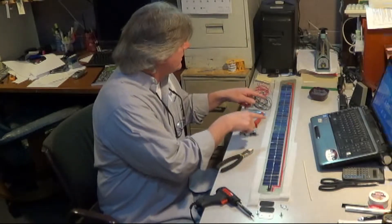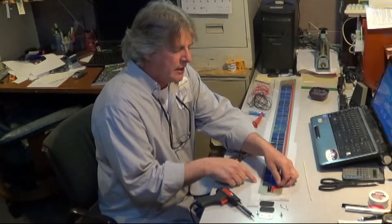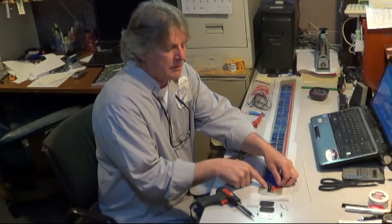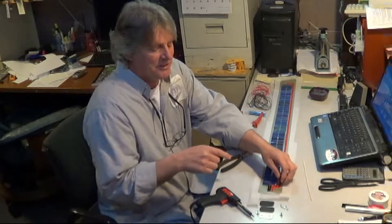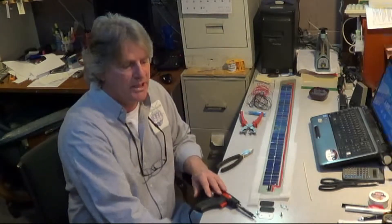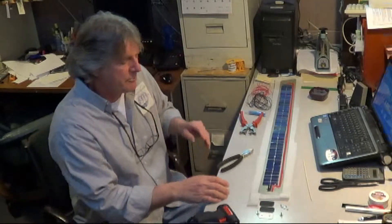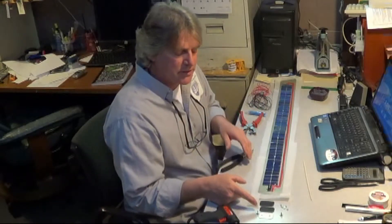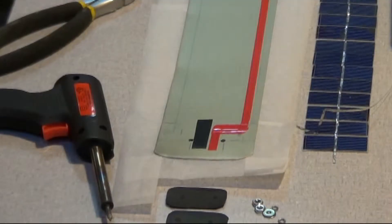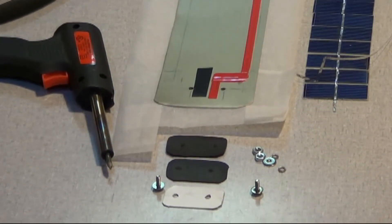What we're going to do is go ahead and put these wires on the bus line — the red one — and also hook up a negative wire here on the cathode side of the first solar cell. So we want to go ahead and turn on our trusty all-solar-powered workstation inverter. We're going to heat up our iron, and while we do that, I'm going to start installing this squeeze connector at the end. It's kind of important to have something to place the wire in while you're working with it.